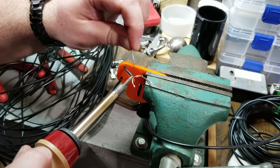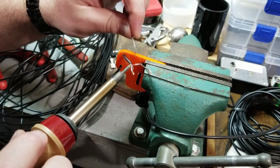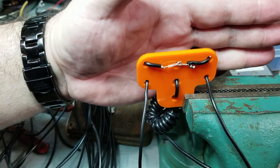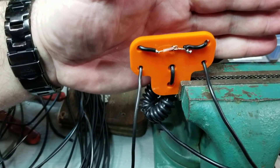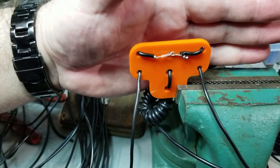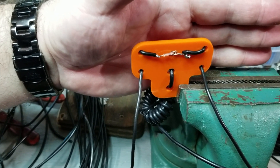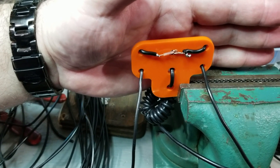Now we're soldering the two together — this is one of the dipole ends to the center conductor, basically making them electrically connected. We'll trim this off to make it pretty. We've got one of the dipoles now soldered to the shielding of the RG174, and we've got the other dipole now soldered to the center conductor, and we've got them neatly moved to either side. We're going to put some goop — some kind of glue — just to make it a little bit more permanent. We've got an end on the other end of the 174 and now we've got the two dipoles connected. Won't be long before we'll be testing SWR.